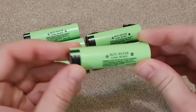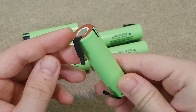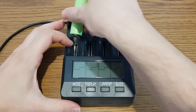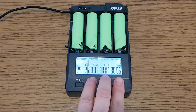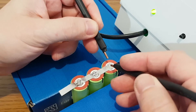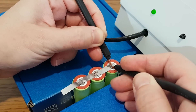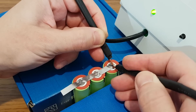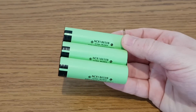What about the battery? I have a few lithium-ion cells from an older project — I bought them about 2 years ago, so I need to make sure they are still good. To test them I will use my Opus charger. After a few charging and discharging cycles at 700mA they reveal a real capacity of about 3Ah. I will use these 3 cells because they have a similar capacity. These cells have nickel strips already attached so you can solder them easily, but I will use my DIY spot welder. And there it is — a 3P battery pack with a capacity of 9Ah.